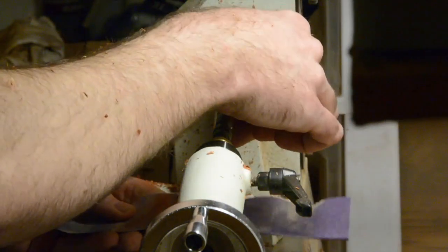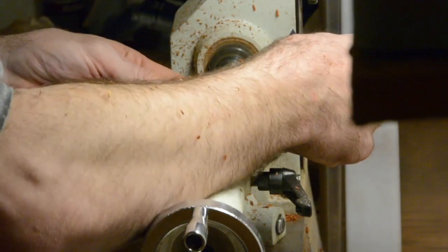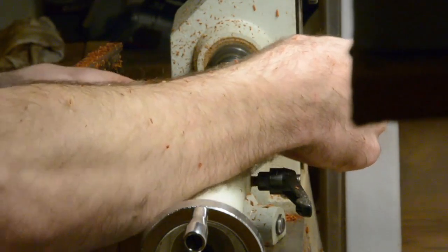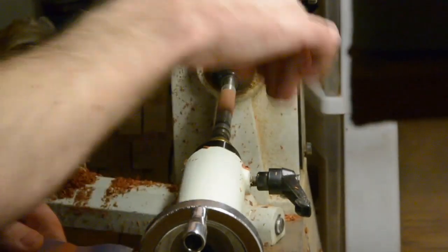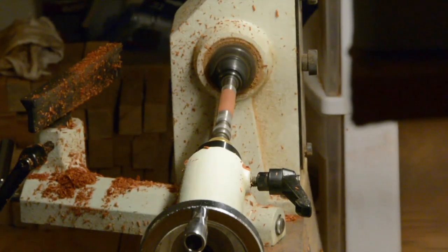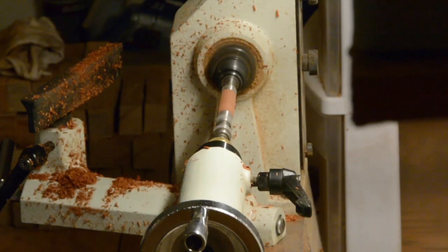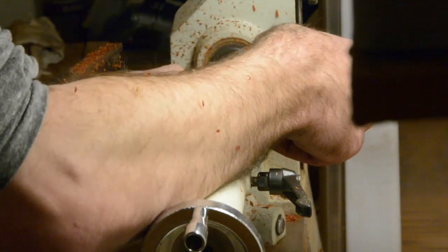Well, okay, so 100 grit doesn't get it really smooth. Types of grits. We're only doing four types of sanding. So 100 grit, 240, 320, then stopping at 400 before we start the polish. We're already on the second bit.